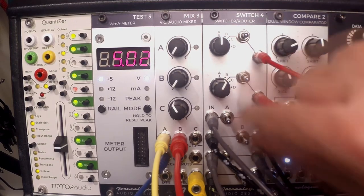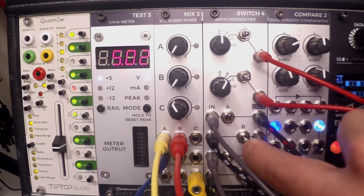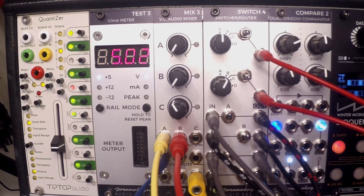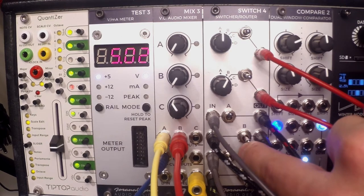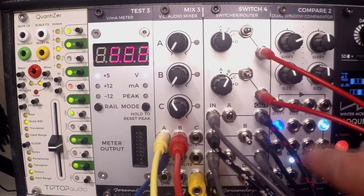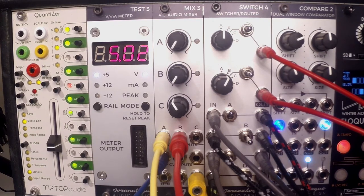So what happens is, for example, if I engage the first input, it just passes some clock from Tempi. As I engage sequencer clock, it now combines these clocks with the module. I can mute it. I can simply use that as a distributor for these two clocks. Of course, it gets more fun if you connect four clocks and combine them and use it only for one module, because you get more variation. But I wanted to show you an example with some more modules.